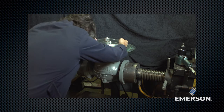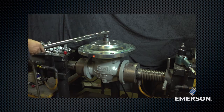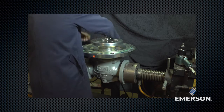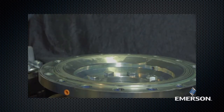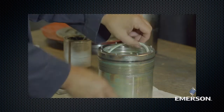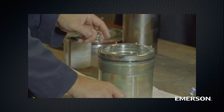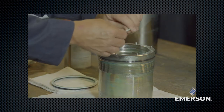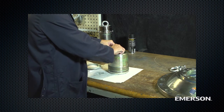Go back to the body. Align the screw holes on the cap to the sleeve guide screws. Utilize the cap to unscrew the sleeve guide and remove it. There are two sets of O-rings and anti-friction rings. Start with the first set: inspect the O-ring and anti-friction rings for damage or wear and replace if necessary. Flip the sleeve guide over and inspect the second set of O-rings and anti-friction rings for damage or wear, replacing if necessary.